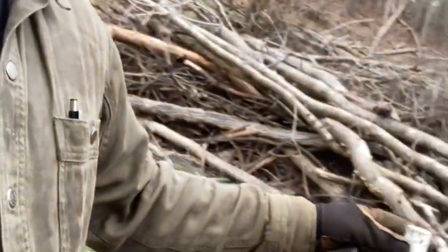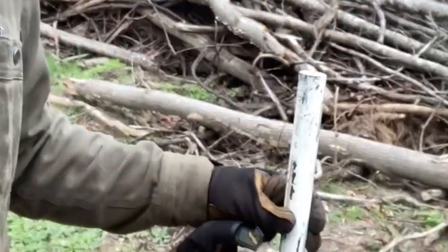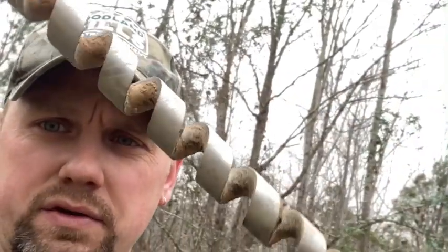These thicker ones are an inch and a quarter. The way I install them is I just drill a hole in the ground — I have a big drill bit and I drill about 18 inches down and then pound it in with a T-post driver. That big old drill bit there we just ordered from Amazon. For the thin ones we don't even have to drill — we just drive them straight in. It takes two pounds with a metal T-post driver and those things are down.